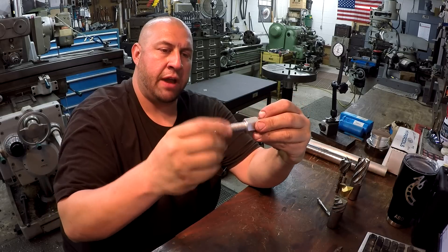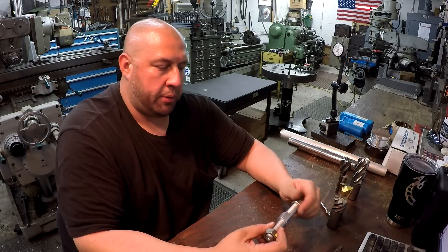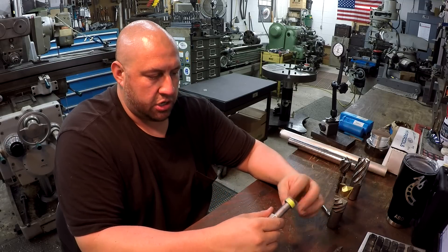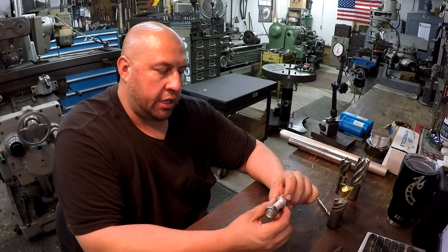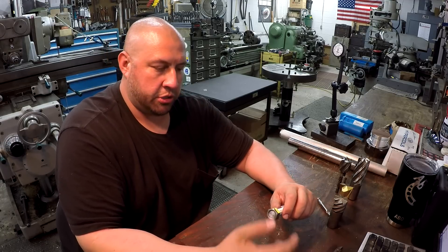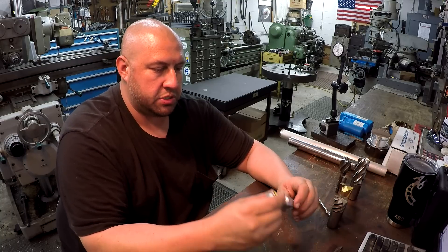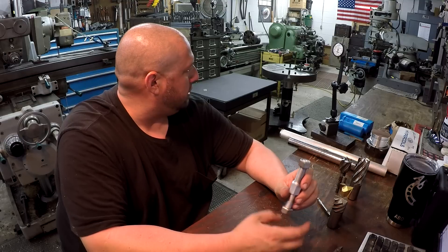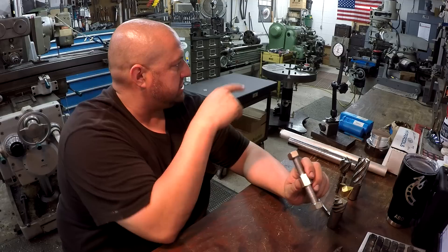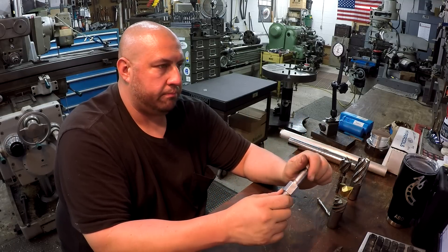I was lucky and found my bag of left-hand nuts this evening. I had put together a bag of left-handed nuts a long time ago — went to the hardware store and bought a bunch of them, labeled them in little bags. Oftentimes I would get a job like this where people needed something threaded with left-hand threads, and I didn't have a good way to gauge it other than measuring thread pitch, so I liked having nuts around to use as a gauge.